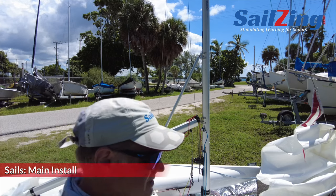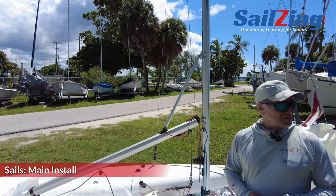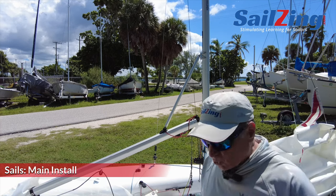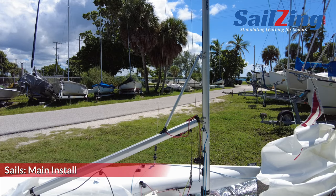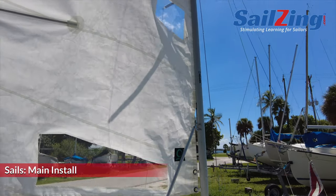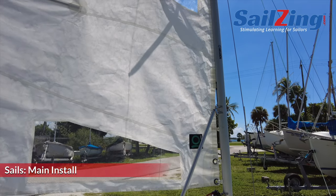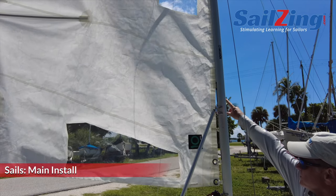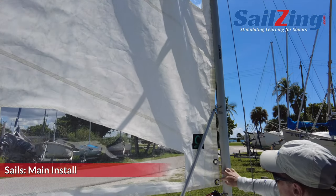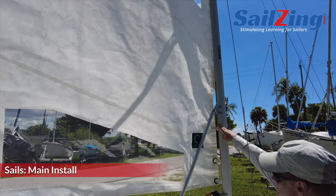The M15 has a loose-footed main, so it doesn't slide entirely down the track. So you basically have what I'll call plastic lozenges that slide in at certain points on the mast and on the boom. So for the main halyard, you attach it to the head of the sail, and then you run the sail up the track right here. That's where the sail inserts into the track. But down here, you'll see that there are three of what I've been calling lozenges. The access is right here. So two of them go down below that slot, and one of them goes above the slot.